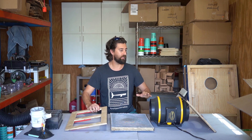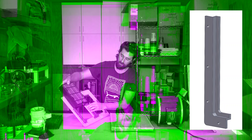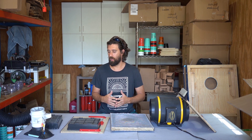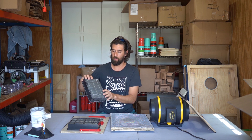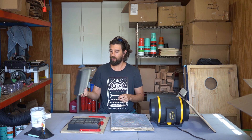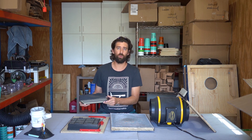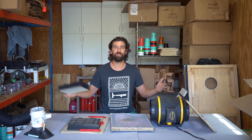That's where this is from, so this is perfectly put together — it was beautiful, and I was really excited. I even have some 3D printed brackets to hold the filters, so that did a great job, it did exactly what I wanted it to do. What any fume extractor is, is a series of filters going from a large particle to a finer particle down to gases. Originally on this I had just a mesh filter laying on top — there are kind of like these cutouts. These are HEPA filters, just off-the-shelf HEPA filters for a household air purifier. They're absolutely disgusting, so I probably should be wearing gloves. I'm filming during the coronavirus times, that's why I've got time to do this.